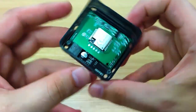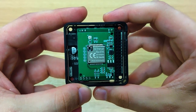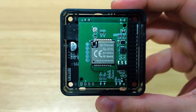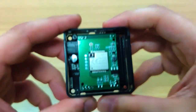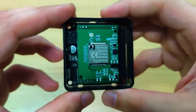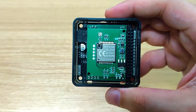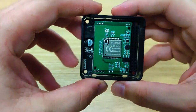If we flip it over to the other side, we can see it's a LoRa module — AI Thinker RA07H. Looking closer, this is ROHS and FCC certified, as well as 803 to 930 megahertz broadband. It's important to know that different frequency bands are functional in different countries, so you need to make sure it's compatible with your country. Other modules like LTE and Sigfox don't have this kind of issue.